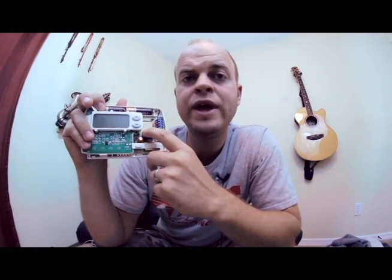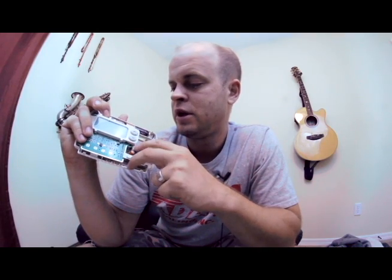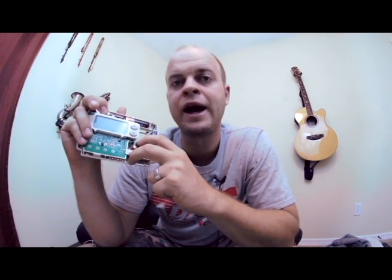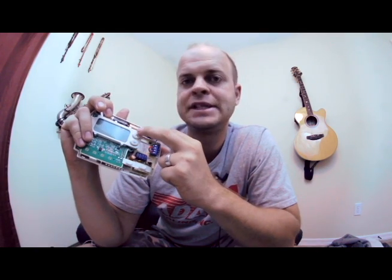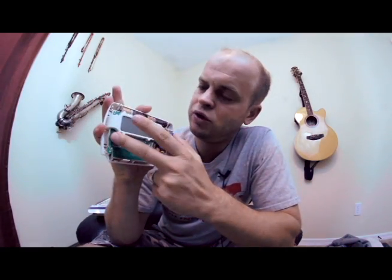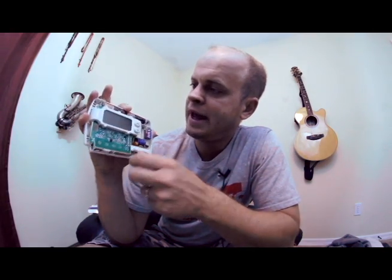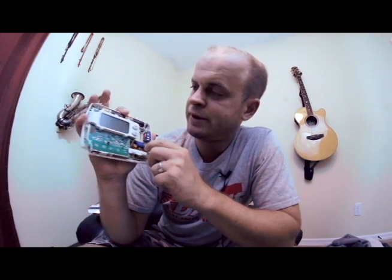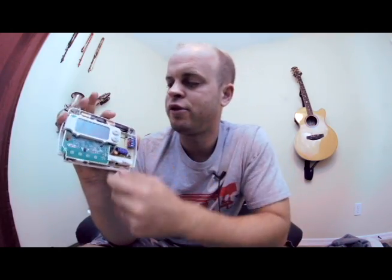At Adams Cooling, we like to use that fifth wire if it's available. Some people have cut it off, but if it's available, we're going to use the fifth wire for the common. That will energize your thermostat to the transformer, so if something happens to the batteries, it'll still be energized. When you put this in, put the base plate in first and screw it in. Make sure you turn this over to electric, then pull out this tab right here — that will start the thermostat.